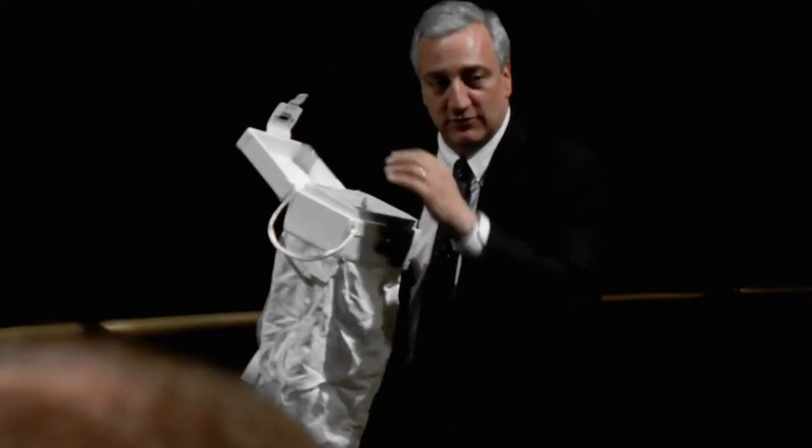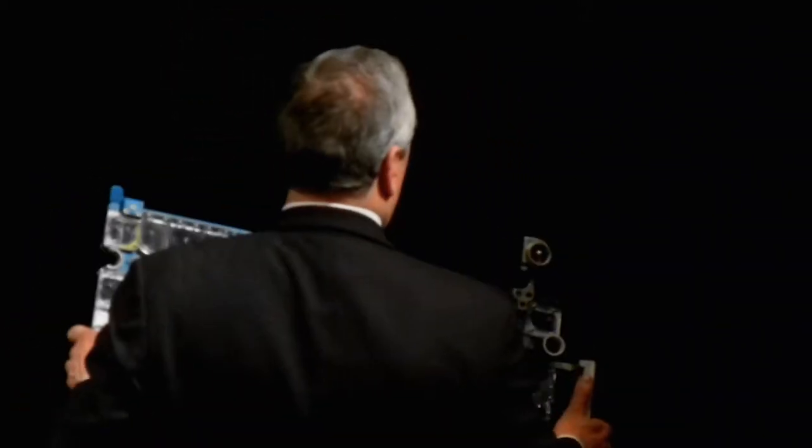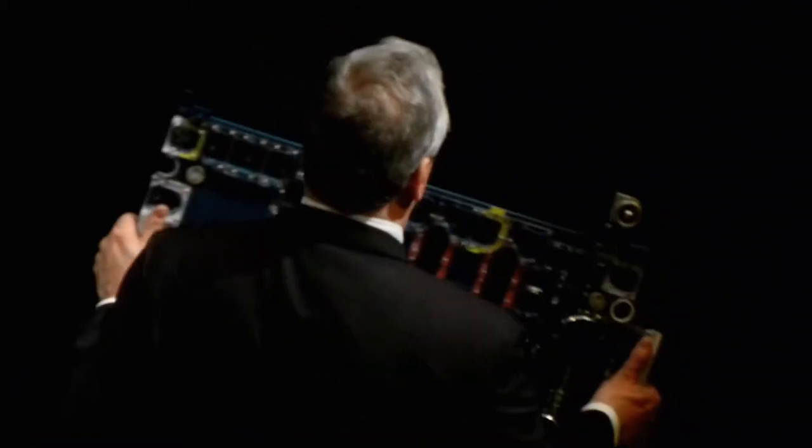The handrail went in here. We took out four screws on each of the extremes of where the panel was, put some big guide studs inside, and then installed the capture plate on top. Once this was in front of me and secured, each one of these holes lined up with one of the fasteners that I removed with the power tool. The hole is big enough so that the tool bit could go through it, but the screw would not come out. So the screws and washers and anything else that kicked up were floating inside. What I was looking at through all these windows were little screws floating around, kept inside by this capture plate. When the last one came off, the whole plate could be removed.